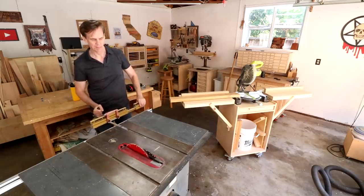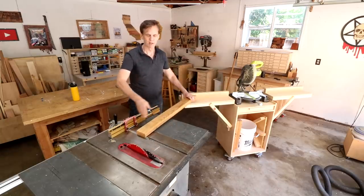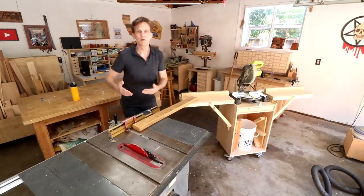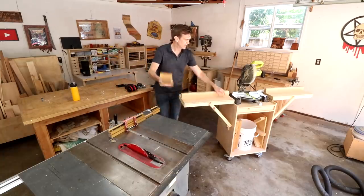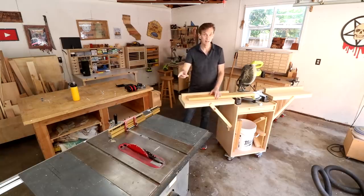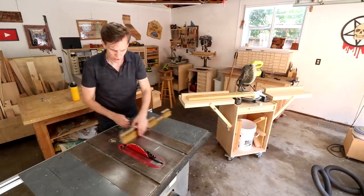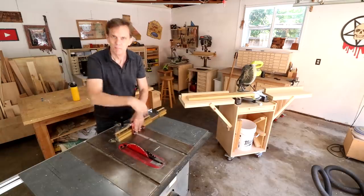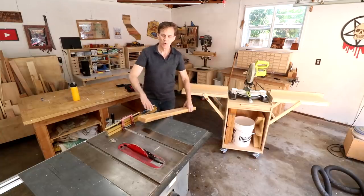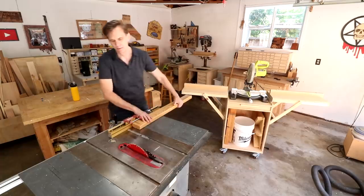The second thing to consider is how long the board is. For a single cut, I can really use either tool. But if I want to make a series of cuts all the same size, the extension wings on my miter saw make it much easier to set up a stop block and make repeated cuts. A table saw is great for repeated cuts that are pretty small — I can set up a stop block on the fence and just go over and over. But with really long boards hanging over, cutting on the table saw can be really cumbersome without an extension table on the side.